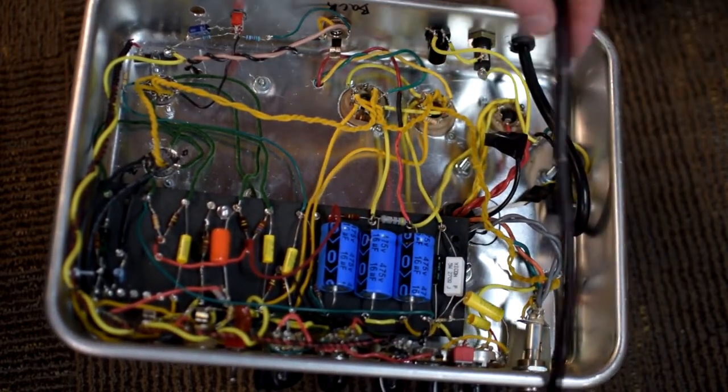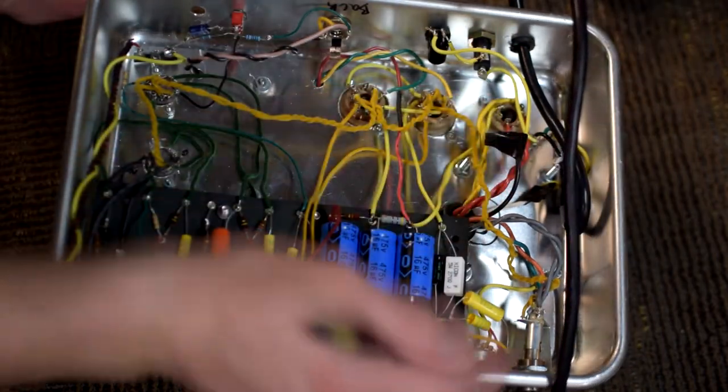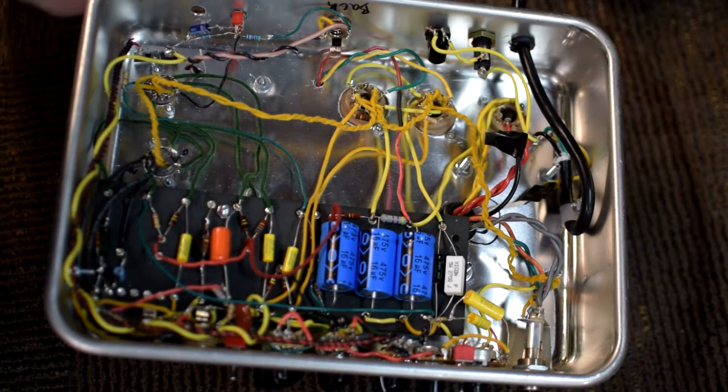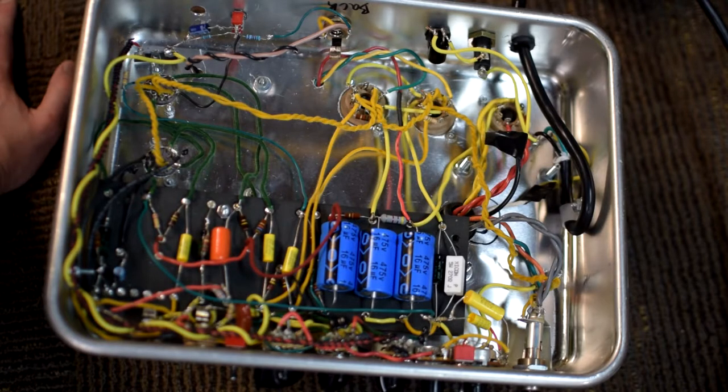First, we've got the power cord. The power cord enters the amp right here, and it's going to be plugged into the wall. The wall, I live in the United States, is rated for approximately 120 volts of alternating current. Now, 120 volts AC might vary a little bit, and typically when I measure the voltage coming out of my wall, it's a little bit higher, somewhere in the range of 123, 124 volts AC.